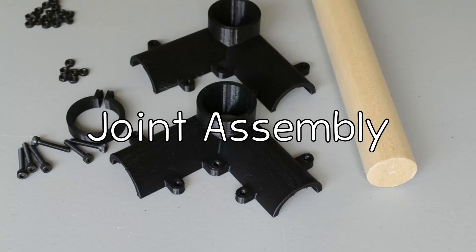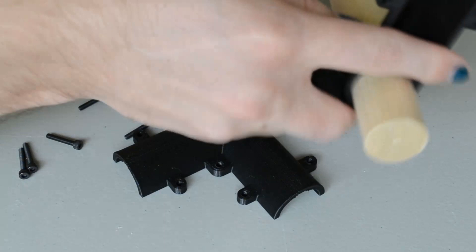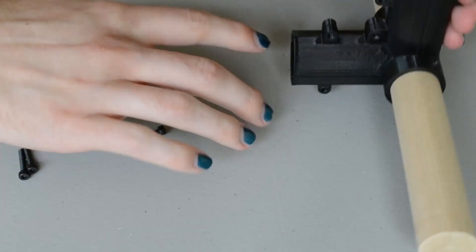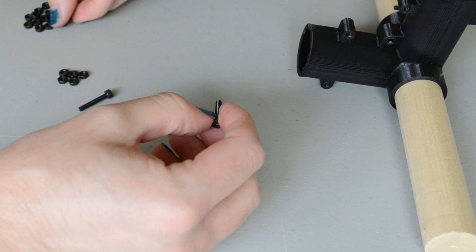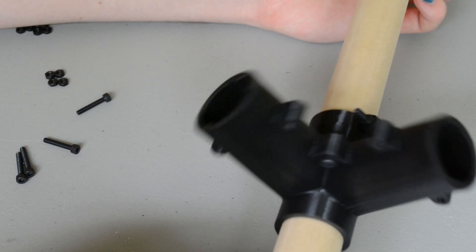Let's take a look at how each of these corners go together. Here is a small sample piece: the retaining ring goes on the bottom, then the lower bracket and then the upper bracket just slide onto the dowel. You'll notice I am struggling with these a bit — I have increased the tolerance for the models I am publishing. The retaining ring is bolted together to hold the pieces in place, and then the pieces are bolted together with the perpendicular dowels in place.